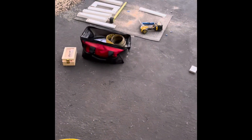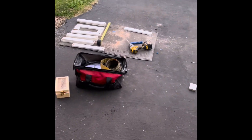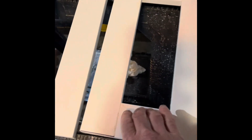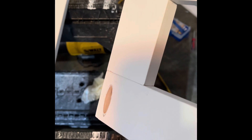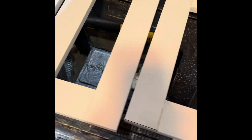I'm going to take my time and work on this more carefully and post a video once I've got this stuff all glued together. I may try caulking — I have not liked the putty; it has a long dry time and doesn't paint very clean. This time I chose to only put one screw in with wood glue, then put a wooden dowel filler on the pocket screw. I tried caulking this time instead of wood filler and I really was not having very good luck with the wood filler when painting it. I'll let these dry overnight.